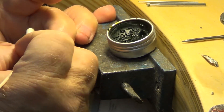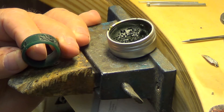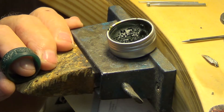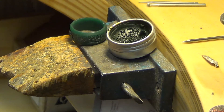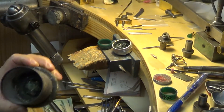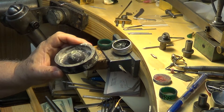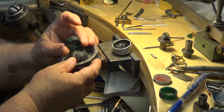Alright, now we've got her polished. Next thing we've got to do is get it ready for casting — mix our plaster, cast it, come back and clean it up. Hopefully she'll have a ring soon. This is a flask right here, and we'll screw the wax mounting on here at an angle slightly like that, then put it on the machine, vacuum it out, and see what we've got.